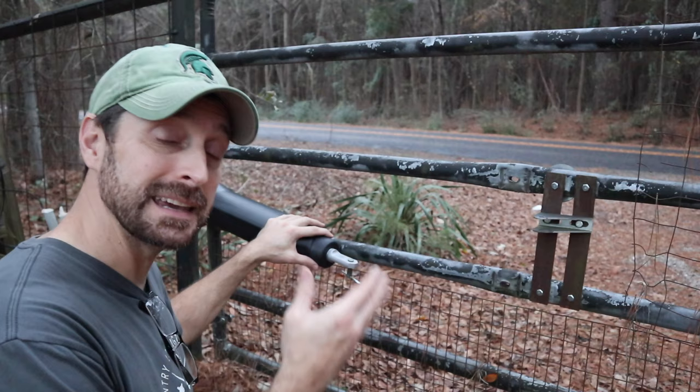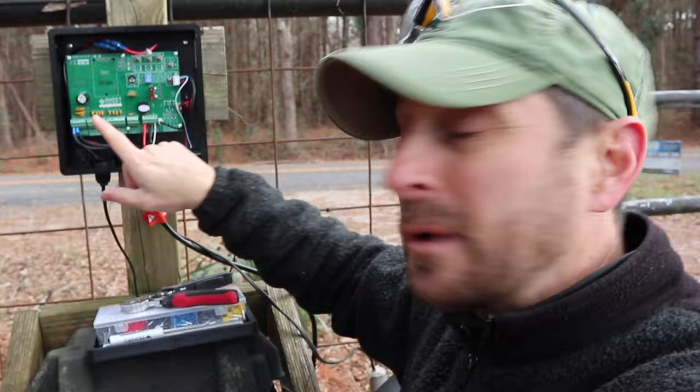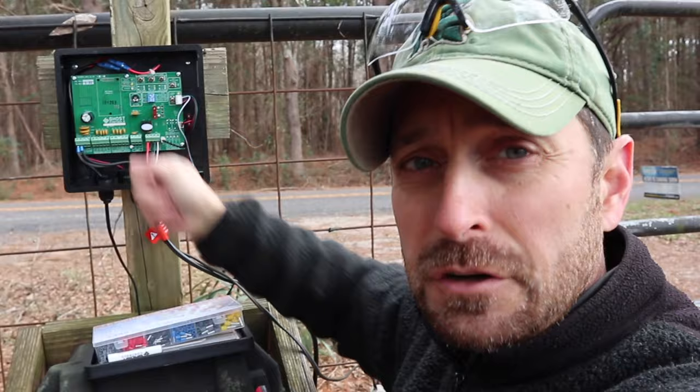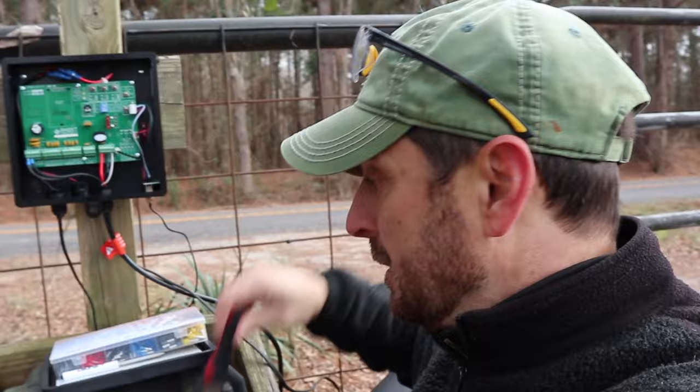We're back because we finally got the extra part I needed — the $27 adapter to hook it up to my three-inch metal post at the front gate. So we got the adapter; let's get this thing on. We also got our solar in. It is absolutely essential that you use ferrules, because trying to get wires into these tiny little terminals is really difficult — Mighty Mule has the same issue. If you have a ferrule on the end, it's easier to push it in without the thin wire strands fraying. Get a ferrule kit; I'll leave a link to the one we have and the ferrule tool in the description below.